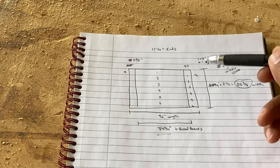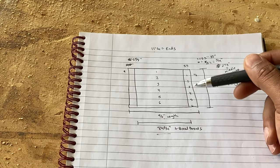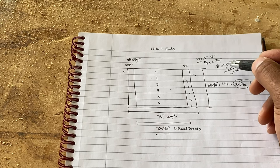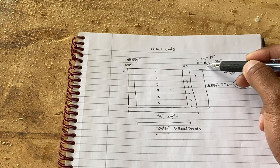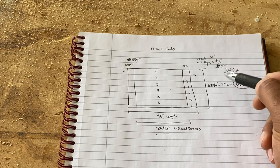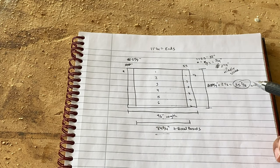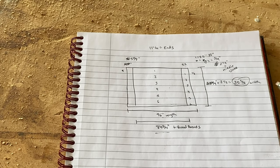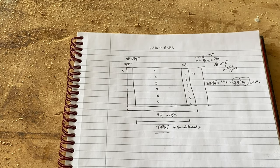Now we need to figure out the width, accounting for all the spacing. We've got six boards, and we want our width to be a little more than just the six boards, so we're adding an extra two-and-a-half-inch sliver in the middle to keep it symmetrical. The Trex boards alone are 33 inches; accounting for all the eighth-inch gaps gives us three quarters of an inch. So 33 plus three quarters plus two and a half gives us a total width of 35 and three quarters. From these measurements, we can extrapolate the apron and table base dimensions, and we'll do an inch-and-a-half overhang on all surfaces.